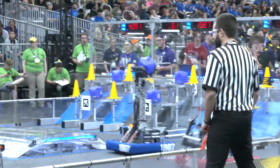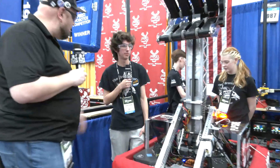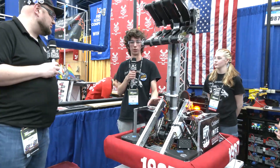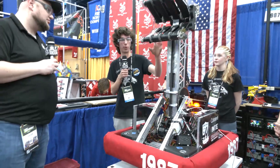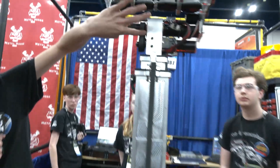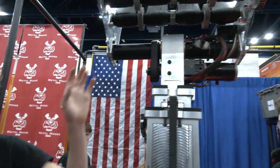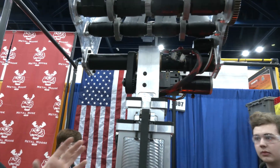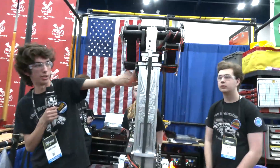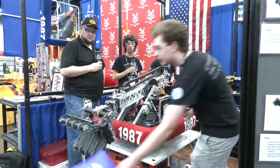Let's demo some of this. The last thing that's really important, added between regional two and champs, is that we had issues with this belt slipping on the claw. Because we're using an absolute encoder in the 2x2 to determine the angle of the wrist, if this belt gets messed up, all of our positions are messed up. So what we did is add a limit switch here — there's an auto homing sequence that comes down and hits this bumper against the limit switch, resetting our offset points. That's the other big feature for the arm.